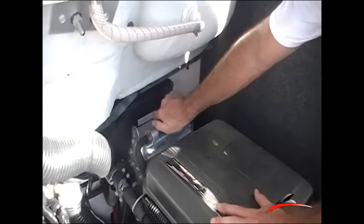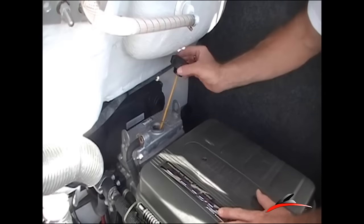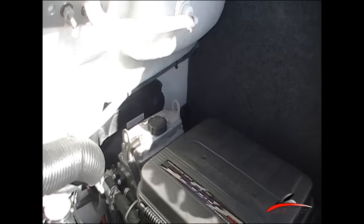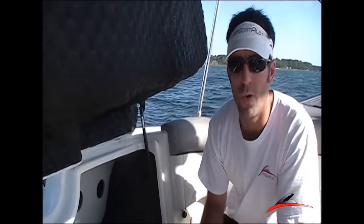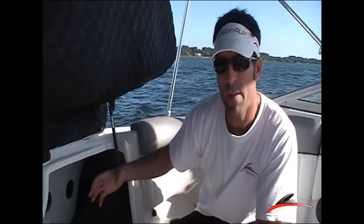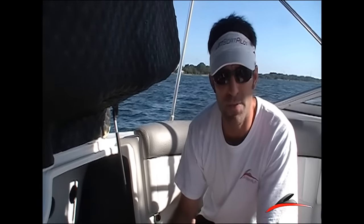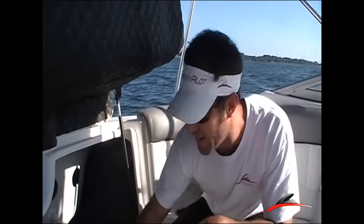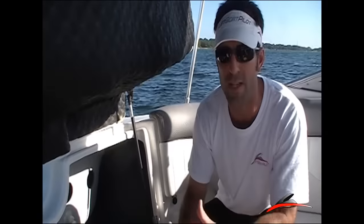Right back here in the back, this is your oil reservoir. The best way to check your oil — we've been cruising here, so it's going to be up on the stick. What you're going to want to do is start your motor on the hose or start it in the water and let it run for at least a few minutes, maybe two or three minutes. Once you've done that, then you can check your oil. That's pumping oil back into the reservoir, so it's the proper time to check it. If you check the oil when the engine's cool, it's going to show up low on the stick. You do not want to service the oil at that point, because if you do, it's going to be over-serviced and oil will actually bleed back into your air filter. The air filters are found up underneath these covers here. So make sure that you run your motor first, get it good and warm, and then check your oil. That's the best way to do it.